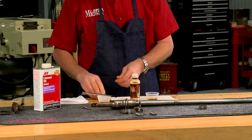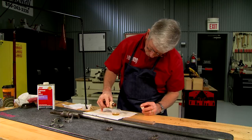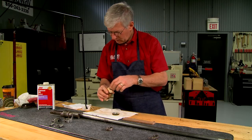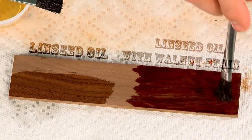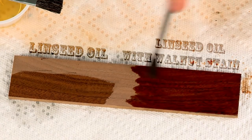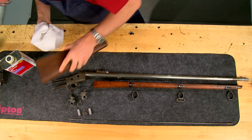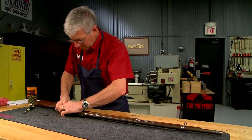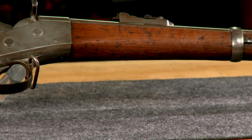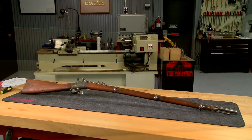If a darker color is desired, oil-based walnut stain can be added to the linseed oil, although the stocks will darken naturally over the next few days. Excess oil on the surface of the wood is wiped off. The oil-soaked rags are disposed of properly, as they can spontaneously combust and start a fire. Now I can put everything back together — what a beautiful old gun, enhanced in this case by cleaning. Sometimes it is appropriate to properly clean an old gun.